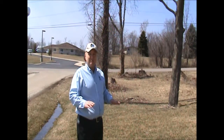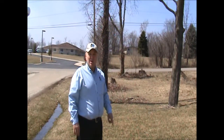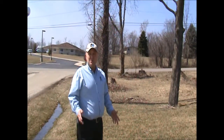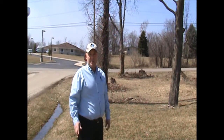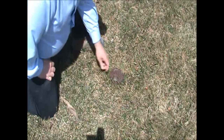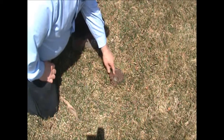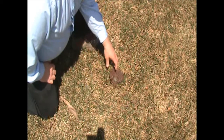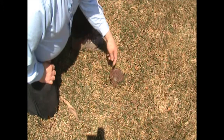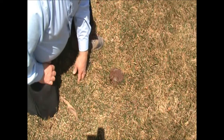Look around your yard for a small metal cap — the area around the Buffalo box is usually a little bit depressed. That small metal cap is the shutoff the city uses to shut the water off. You don't have the tool to go down in there and shut the water off yourself; that's done by a city or village official. The cover is about four and a half inches in diameter. Remove the bolt and it reveals a long shaft that goes down typically about five feet in the ground. The city official has a long tool that goes down, sits on a nut, and they can turn it to shut the water supply off to your home.